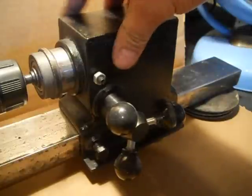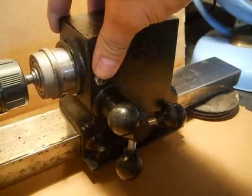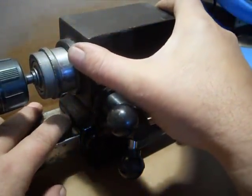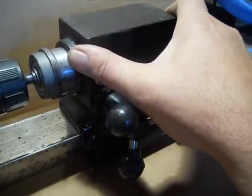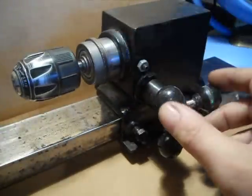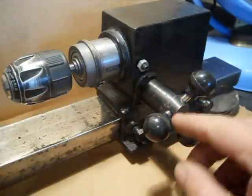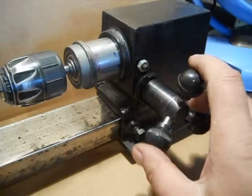This is a piece of half-inch mild steel which I smoothed down with my sander — a flap disc — so it slides on here pretty good. This slides where you want it, then you can adjust these bolts. You can adjust this for this direction. There's a little bit of play, but I may have to put just a small shim in there and smooth it out — maybe a piece of aluminum. It needs to come up in the front just a hair, but for wood that's no biggie. These little rods were shortened down, and the knobs screwed on the same as they're screwed in here. I just cut them off and used some quick-weld epoxy, so you've got a little handle.